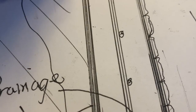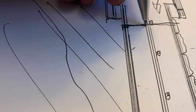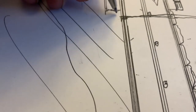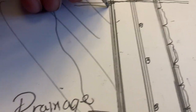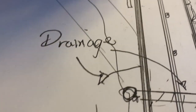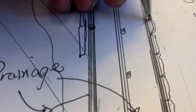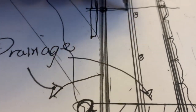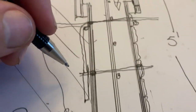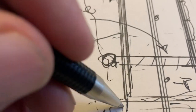Well, there's two different ways, okay? What I did is I drilled holes in here, and I put a 3/8 rebar in here like this, across here like that. I'm sorry. So I use a 3/8 rebar, bring it across here, and of course it's sticking out on both sides. Then what I do is I get a piece of rebar in here and over here, and I bend this down over. Now you have this rebar hanging out over here. It actually goes a little further down. Then I have a hole over here, a hole over here, stick another piece of rebar over here, stick another piece of rebar there. So now you have two holes, and you can bend this rebar and make another hole down here. Or if you're gonna wet set this into the concrete, it's not gonna blow that out. And on this side anyway, it's not.